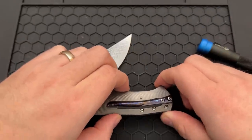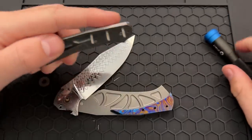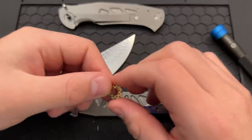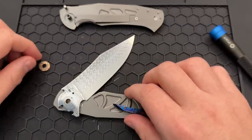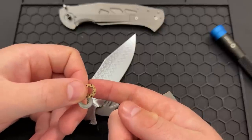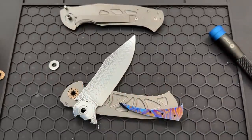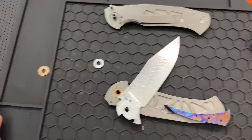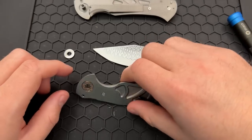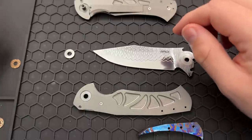Either way, we are almost there. Now we're good to go. So we have removed one of the liners here, and indeed we're seeing that there is a bearing cage, but there are also loose bearings. There is a bearing right there that has come out and it belongs in this little hole right here. We need to be careful about that. I'm going to put this bearing over here and transfer that bearing to be with it, so that way I know that everything in there is from that side.